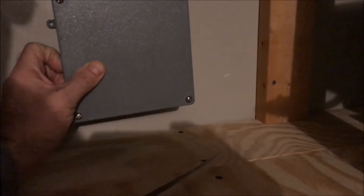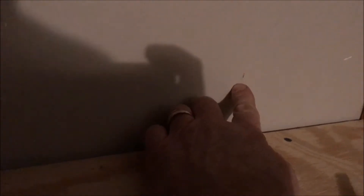I thought if I brought this electrical box in and mounted it a couple of inches up off the wall — I know I have some two-by-fours to deal with for my shelving, but the box is relatively thick. If you put it next to a two-by-four you can see how much thickness you have. I can always run the conduit out the front of the box. If I cut a small hole with my drywall saw at 56 inches, I can mount this over that hole, cut a hole in the back of the box as well, and feed my wires up through the box right out through the hole in the wall into this little distribution box. I'll run the conduit for my lighting around the wall and over to the side of the loft.